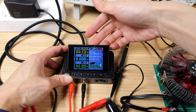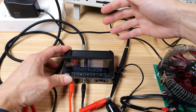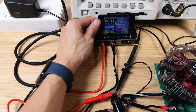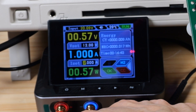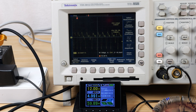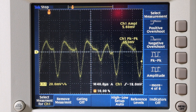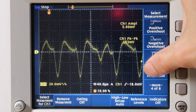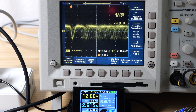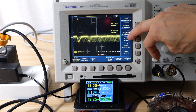I'm having a hard time standing this up at a 45 degree angle — it's a little bit heavy and it just plops down. However, it does go straight up, but I kind of want it at an angle. I'll put it against my scope for now. I have a 12 volt load tester here; I'm going to do 5 amps. Holding at a constant 60 watts, doing a single trigger to see the ripple — at 60 watt output we're seeing about 138 millivolts of ripple. Another single trigger: 153 here. Reduce the load to 3 amps, the ripple reduces to 100 millivolts. Let me go down to 1 amp — the ripple is only 55 millivolts. So the ripple is going to increase the more load that you have.